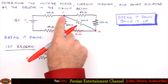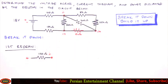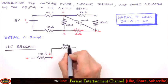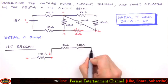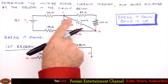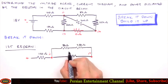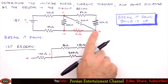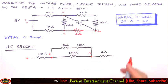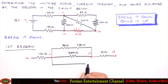After the 100 ohm resistor, the current encounters Junction 1. There's a three-way split at Junction 1, which means these legs are in parallel, so we'll draw them geometrically parallel. The top leg has a 50 ohm resistor followed by a 250 ohm resistor in series, and terminates at Junction 2. Another leg begins at Junction 1 and terminates at Junction 2 — it comprises the diagonal resistor, which despite its appearance is simply in parallel with the top leg. After Junction 2 we have the bottom leg with our 0 ohm resistor, leading to Junction 3.